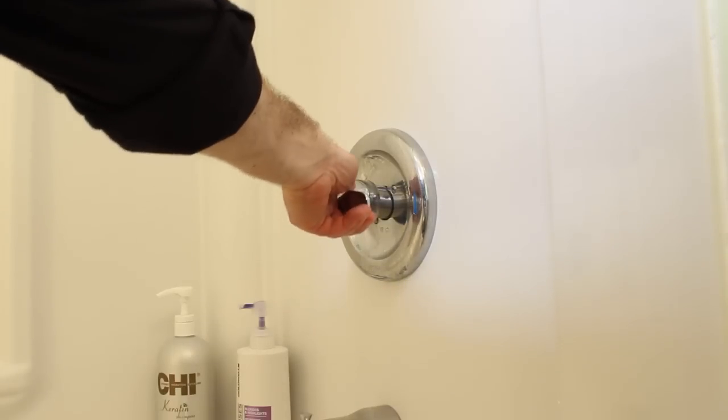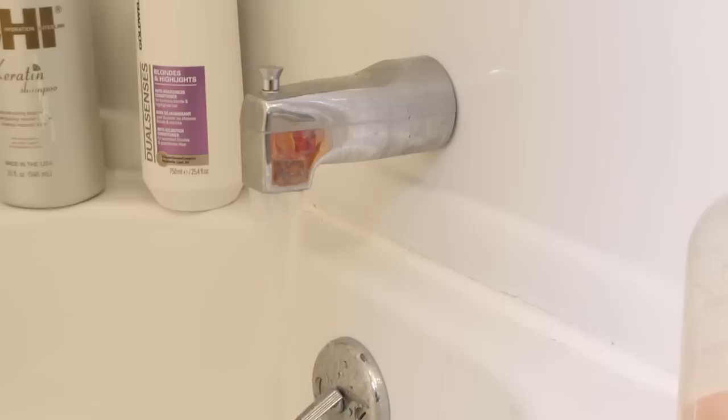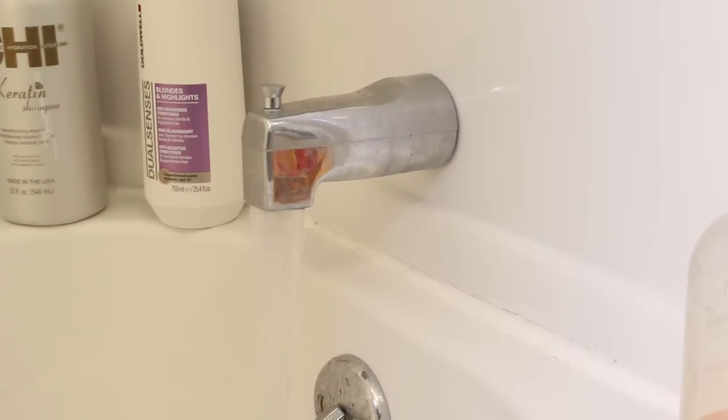Here's a huge tip: fill up your tub with water. First plug it up at the overflow tube, and allow the water to fill the tub such that the water level is right below the overflow pipe. The reason why you want to do this is so that you widen the gap between the tub and the tub surround. It's absolutely critical that you fill up your tub with water before you apply the new caulk, because it will weigh down the bathtub so there's a bigger gap between the tub and the surround or tile. And when you release the water, it will squeeze the material in between the tub and surround and create a really good seal.